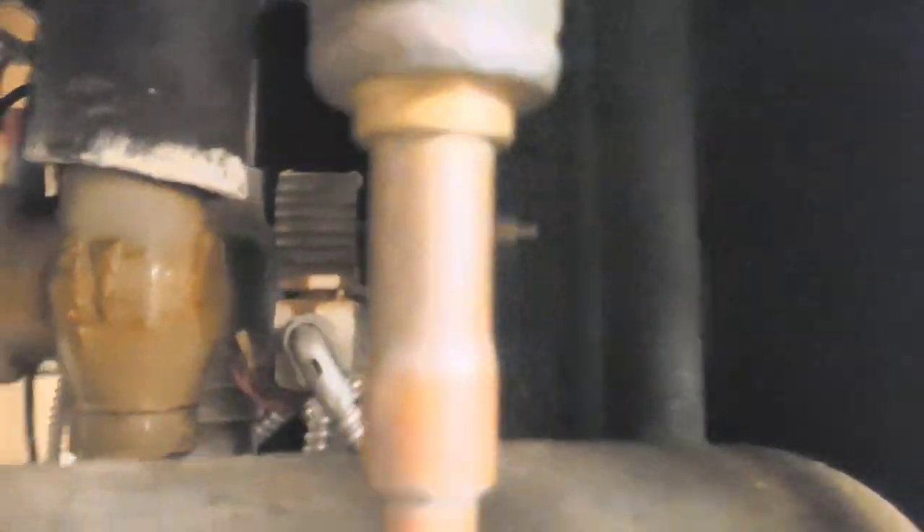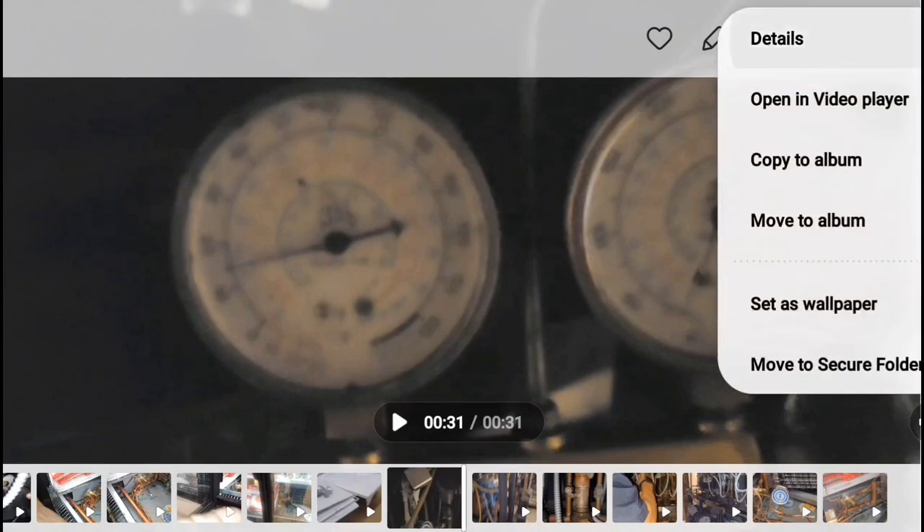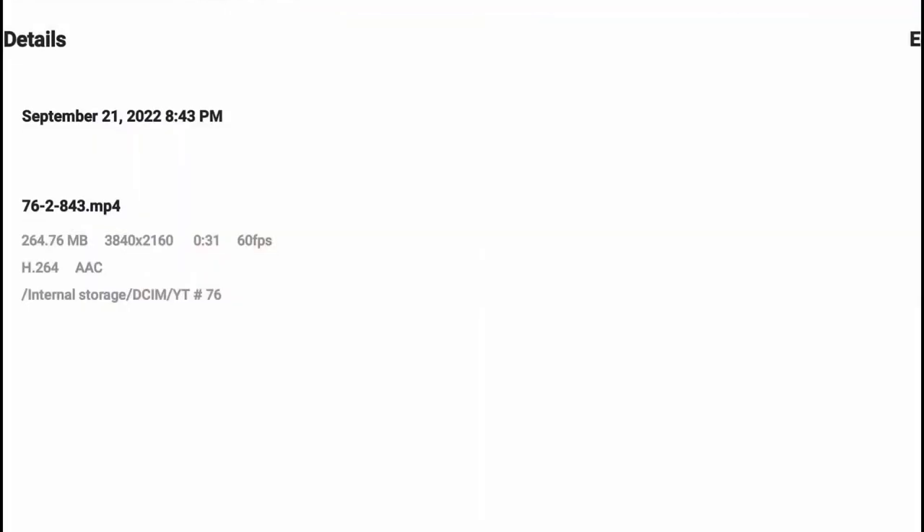Not only that, but you've got to shut off the liquid, and you've also got the suction here, this is discharge, the one three rows back is liquid, and then there's one up top also feeding into the circuit. I finally got it down because I kept getting pressure from somewhere and couldn't figure it out. I think I finally got it going down. I learned - hopefully you can learn from this too - this was at 8:43 that I realized this. It was 7:24 when I started, so I spent almost an hour and a half running back and forth chasing this problem.